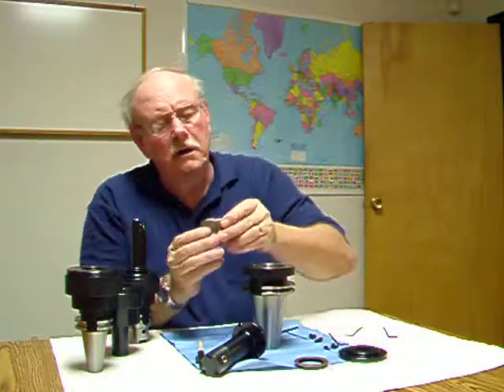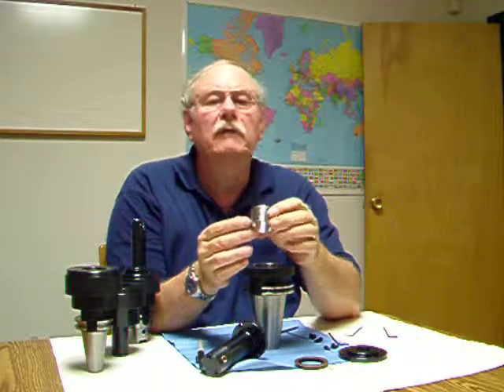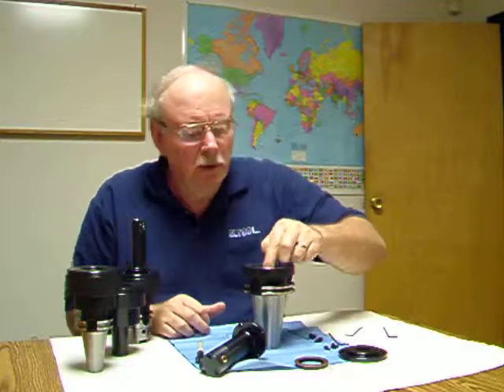Take our reaction ring. Inside the ring you'll see two ball tracks. This one's actually in pretty good shape — in the real world we wouldn't flip it, but because we're demonstrating flipping the reaction ring, we'll go ahead. So now we're going to put the felt pin mark down and drop it back in the tool. The reaction ring is made so that it's not symmetrical, so the ball will ride in a whole new place — that makes it like a brand new part.